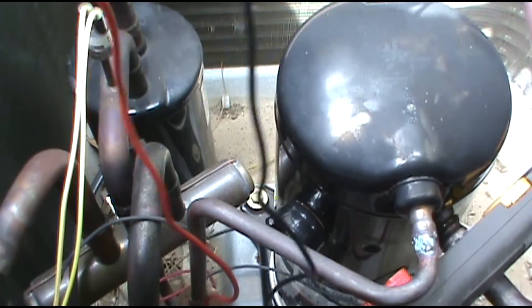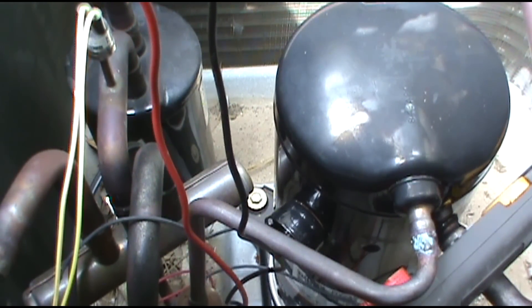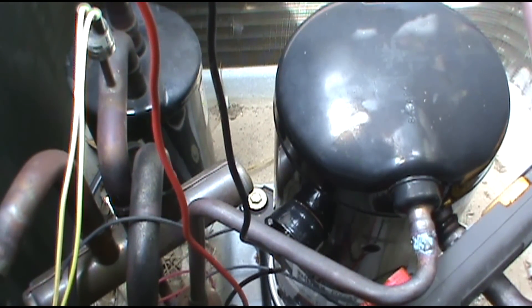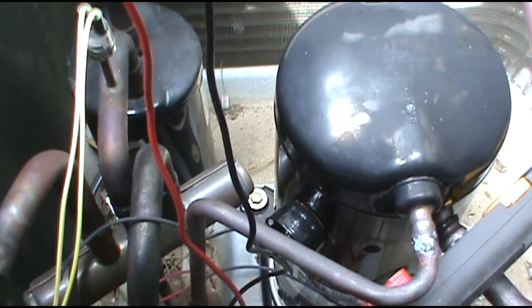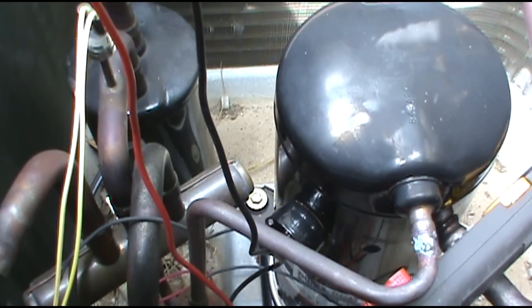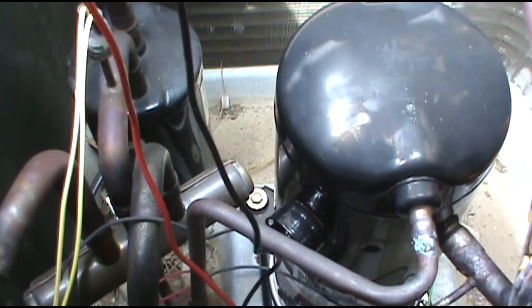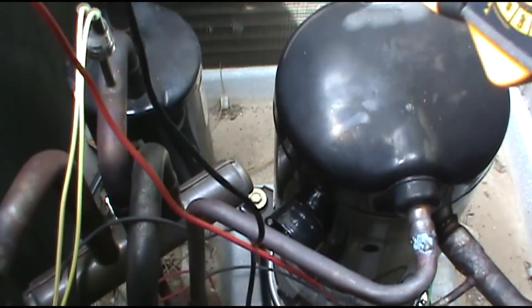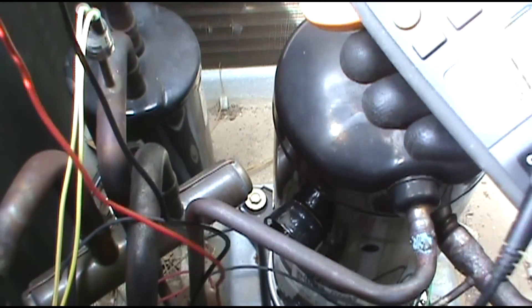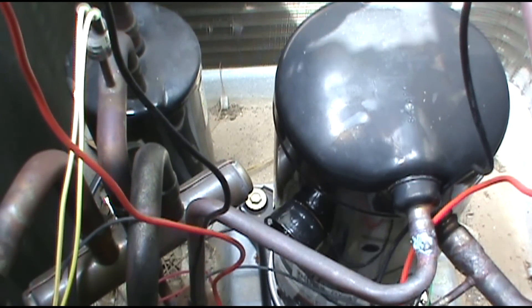Well, it's only three years old — it was installed three years ago. Maybe I'll record a compressor replacement video. Sometimes the owner gets pissed and makes the installer come out and do it, so we shall see. But yeah, that's two ways I check to see if compressors are bad: I do it with my Supco, then I break the meter out and test it with the continuity. Thank you all for watching The Dirty Maintenance Show.